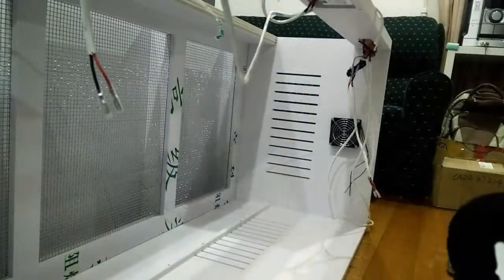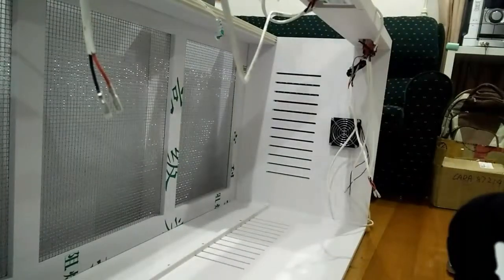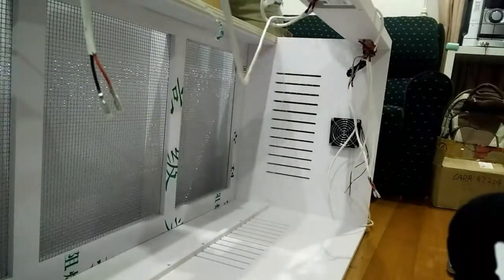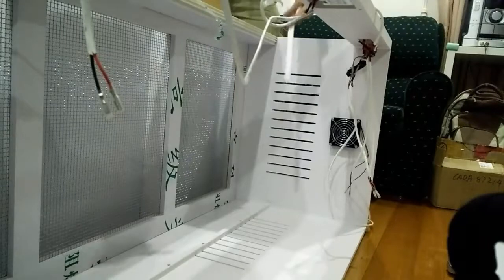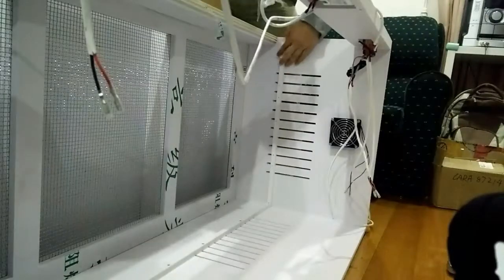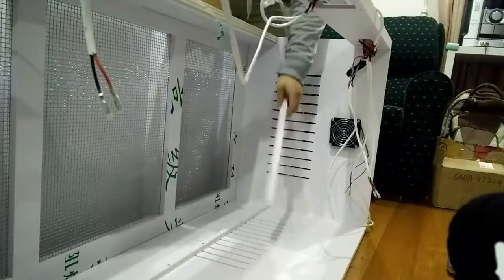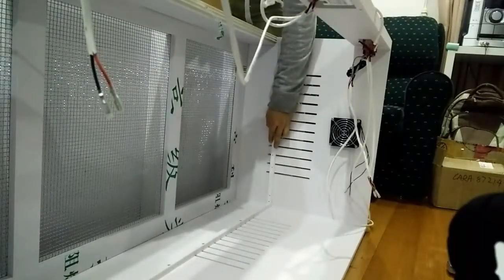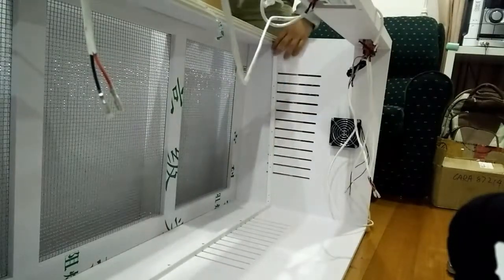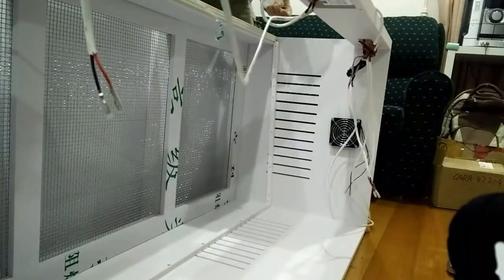installed. And with the Brooder box in the same position, we're going to put the runners or the rails on the sides. We've done the back one on the floor, on the back wall. Just going to put these in. Now this has to be flush to the back as well, okay? There needs to be a gap at the front. If not, your perspex is going to hit it. Let's push back around, sorry. And when you pre-drill the holes, mark out so you actually hit in between the slats. I've got four holes, four screws for this part here.